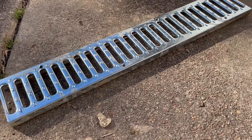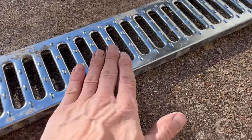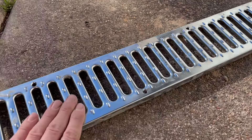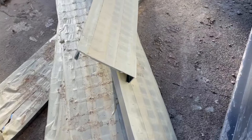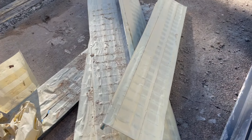We're using galvanized steel grates for this project — real nice and shiny. To prevent a lot of cement from getting on there, we need to be careful because if it sits too long it can scar up the metal a little bit. So we just cover the top of the grates with some tape, and that comes off real easy after you're finished.